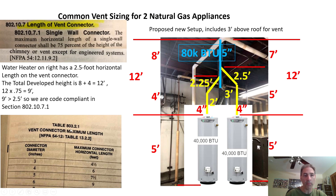Table 803.2.1 tells you that for a three-inch diameter vent pipe there is a maximum connector horizontal length. We already said the horizontal length is only 2.5 feet, so we easily meet code compliance if we wanted to install three-inch diameter pipes — however, the system is not code compliant with three-inch pipes, and I'll show you that later. That is why I put four-inch pipe even for the vent connector. The system we're ultimately going to design will be four-inch pipe for the vent connectors and a five-inch common vent, and I'll show you per code why those are the numbers.